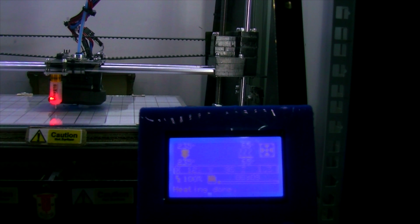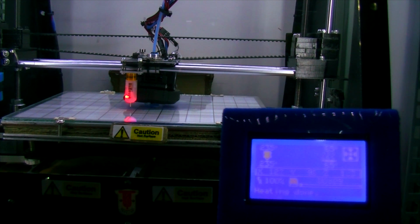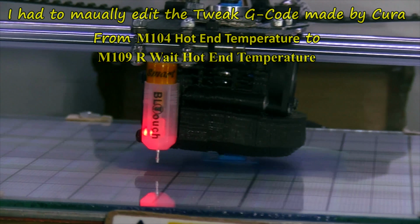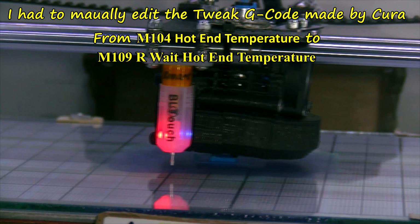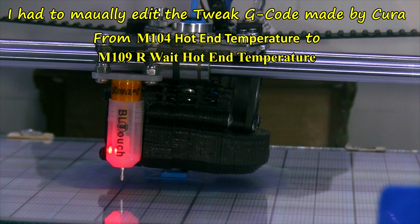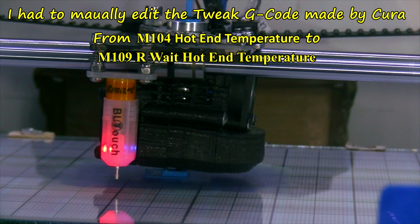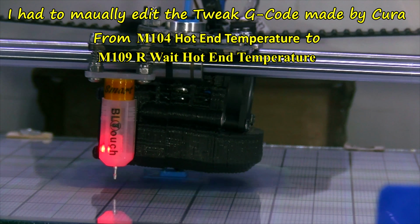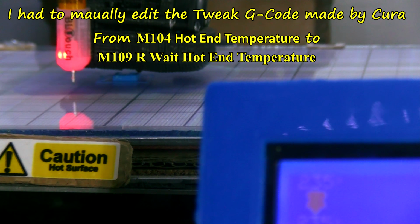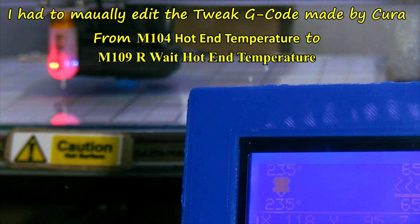So it's going to do 10mm, another 10mm for this part, this next section, and then it should pause again. Put this LED on. And when it pauses, I'll show you the nozzle temperature, which should be dropping to 230 if I've got the settings right, that is. Sorry, the camera's a bit wonky here. You might just make out the actual temperature there on the nozzle. 235, oh, it's knocking there.